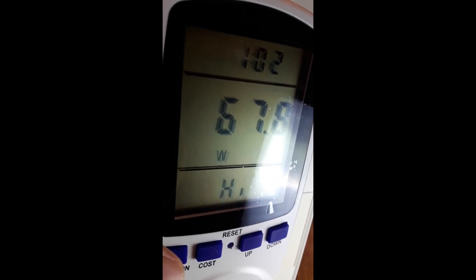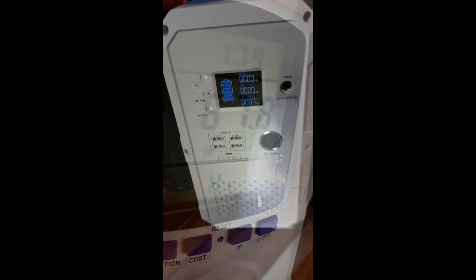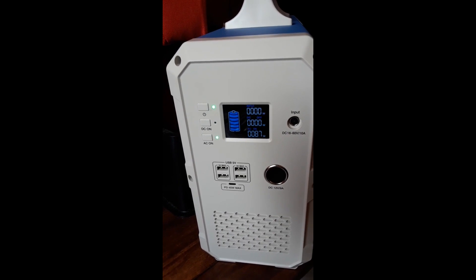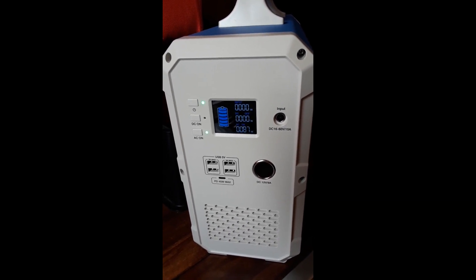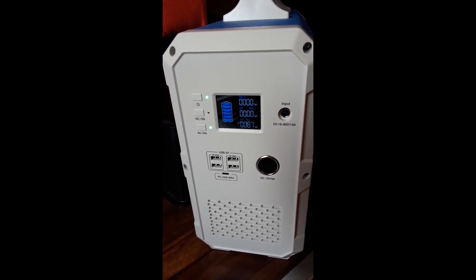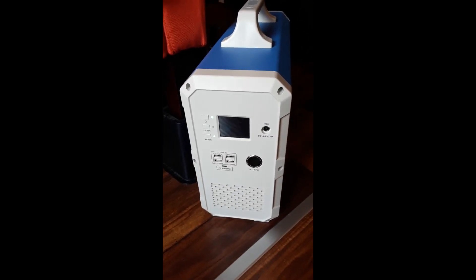I'm going to leave the meter and not reset it so it'll show the next spike. The battery is still full — that's what I started with. If it's drawing an average of around 87 watts, and the unit has 2400 watt-hours, that's roughly 24 hours of runtime. So we'll see how it holds up — I'm going to leave it plugged in, go do some errands, and come back to check.